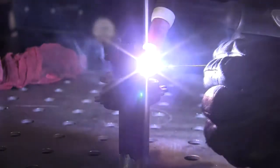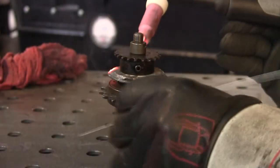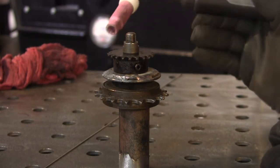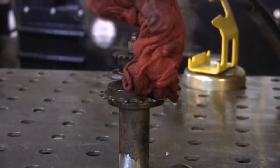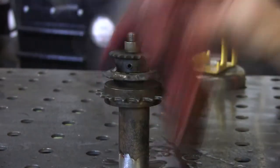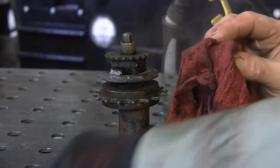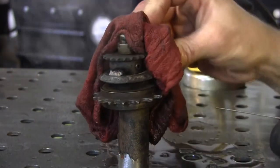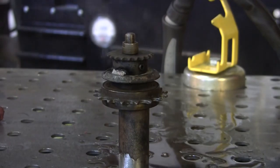You've got to watch out where I had the sprocket on the part of the rim where the spokes go — those little holes you have to fill in. I'll finish this up and make sure it's all nice and true, then we'll mount the axle onto the motor and the motor onto our base. You don't want to cool it too much because everybody worries it's going to crack — well, if it cracks, just weld it up again. Also remember where that set screw is: you can't weld underneath it, so just jump around. It's a machine sprocket, not cast, so it'll hold fine for our purposes.